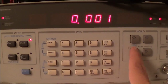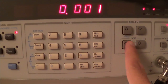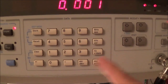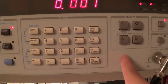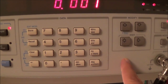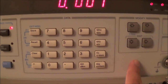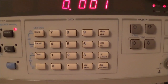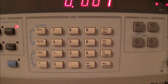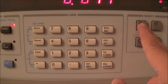I'm going to begin now. I can see it's putting out 1 millivolt, which — since I'm feeding into the aux input — is not going to be enough. It's going to have to be at least 3 figures. I have the volume control of the stereo receiver turned all the way up, so I'm going to go ahead and make some changes here.